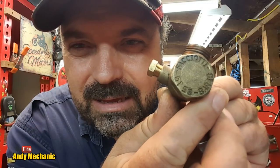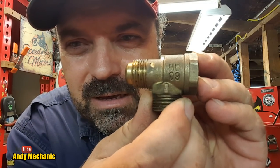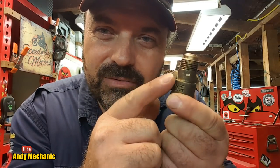Just to give you some identification, I believe this is off an Italian air compressor. There are more numbers on there too. The problem I've been having is that an awful lot of these components look the same but they aren't — there are lots of different variations of thread sizes, and because it's got three lots of thread on there, getting the right sizes all on one component can be quite difficult to locate. The good news is you don't need to buy these from the manufacturer. You can go onto eBay or here in New Zealand onto TradeMe and pick these things up new, really cheap — as little as about five US dollars.